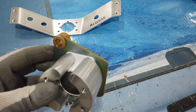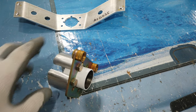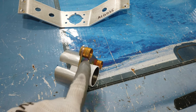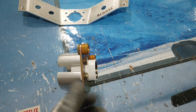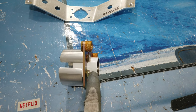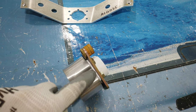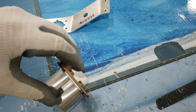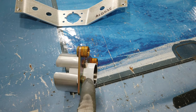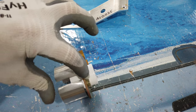There are no gaps. In order to accomplish that, you do not want to draw these together using the bolts. All four of these bolts, I was able to spin in by hand very easily. I didn't have to crank on the bolts to pull these parts together to close up any gaps. These came together really nice on their own, and I was able to run all four bolts all the way down by hand. Then all I had to do was put a wrench on to tighten the bolt.